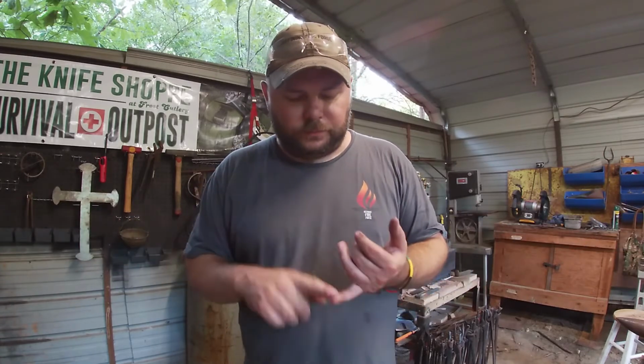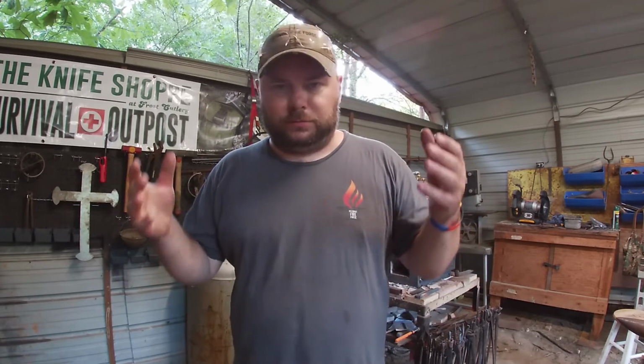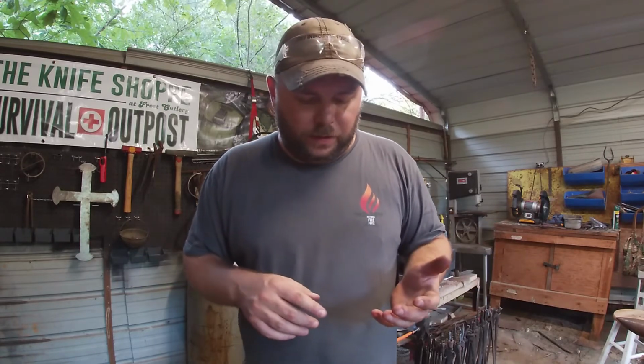So you're going to do a 2-hour cycle on your blade. If you want to do 2 2-hour cycles, you're more than welcome to do that. Put it in there after your oven's heated up. Don't put it in while it's preheating. Let it run its cycle. Turn off your oven. I crack open the door and let it cool down. You can run your cycle again. I know people that do 2 1-hour cycles, so they'll run a cycle, let it cool down, take their knife out, preheat the oven again, and do it again. Really depends on what you want to do.